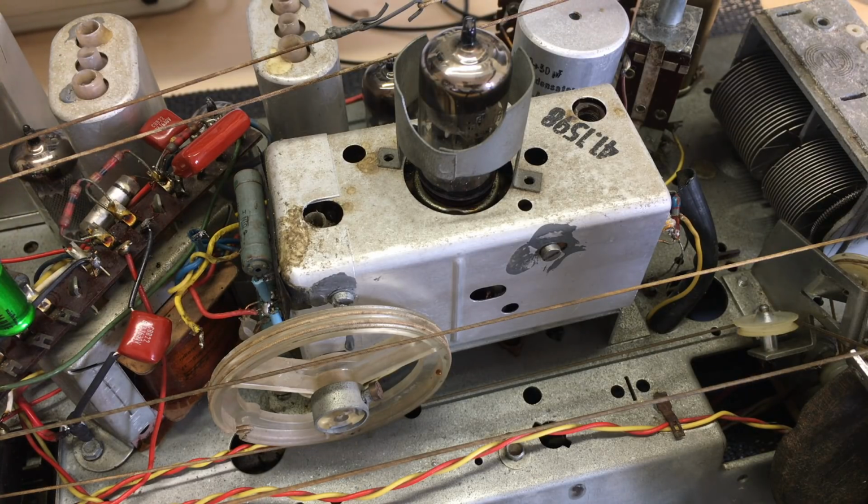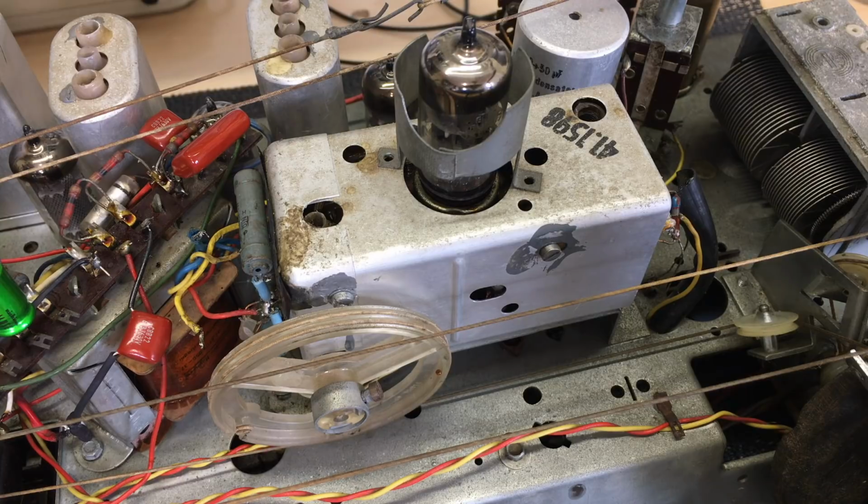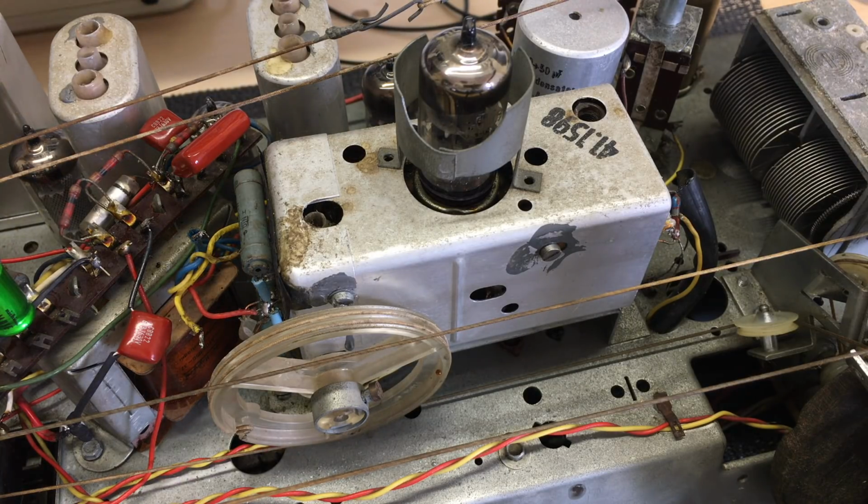on the externals. I'll show you that on the screen in a bit, but there were a few problems related to wiring which someone had messed up, and there's also a case of a resistor that had burnt out. Both of those would have caused the unit to stop functioning. However, what I think happened is the unit stopped functioning because of blown components, and the rest of the damage was done trying to solve the problem, which they obviously did not, or not permanently anyway.